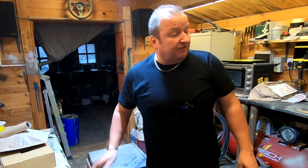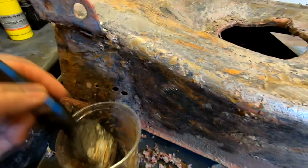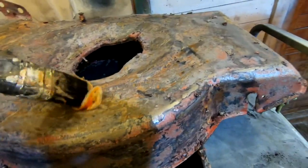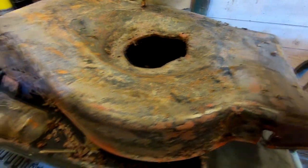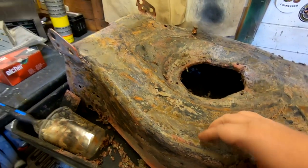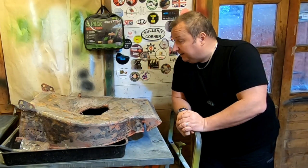I want to get all the parts sandblasted and get them in primer, and get them repaired where they need to be. And I've also got this lawn mower deck here, which I started to strip down. I put my power strip paint stripper on, as I did in one of my last videos, but I've not done nothing with it since - everything's dried out and gone hard again. What I'm going to do - probably in this video - I'll get the sanding disc on it, because most of this is all sort of loose now and should sand off pretty well. This deck is one I bought to replace a rotten deck on another lawn mower, and I'm actually going to powder coat this one.